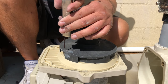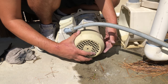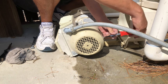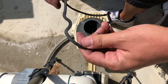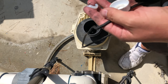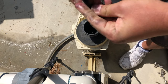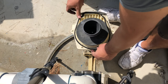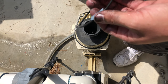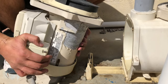The diffuser bolts just go snug. Now put the back cover on the motor, since there's a screw on the bottom that's impossible to reach later. The old pump seals look pretty good, but we need to put some lube on them to keep them healthy. Also lube the diffuser o-ring. Then marry the two pump halves back together.